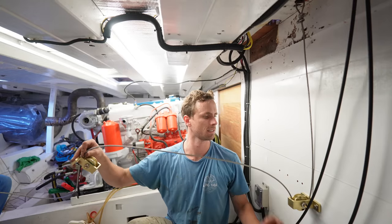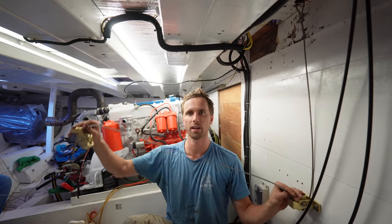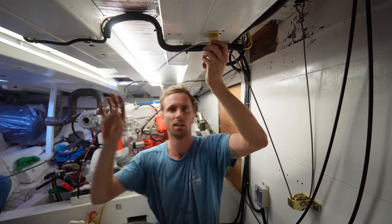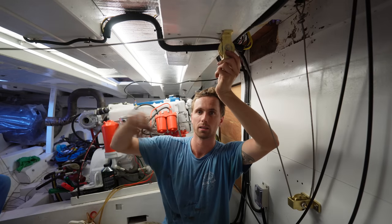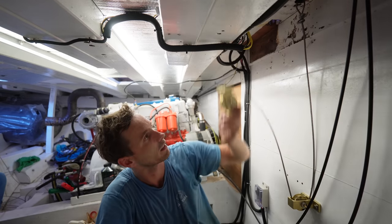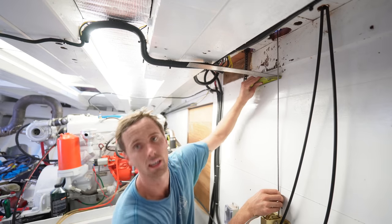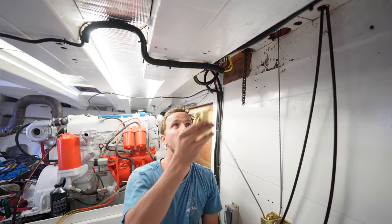Now, of course, it doesn't make sense to have a pulley down here where the maximum of the chain length is, and then the rest to go in front. So we have this other pulley here, which is going to be fastened up here just to get it out of the way of us, and this one will allow the wire to go all the way to the transom. So she'll figure out where this goes. I've drawn a line square from this one over here over onto here, and that is where the top pulley is going to go.